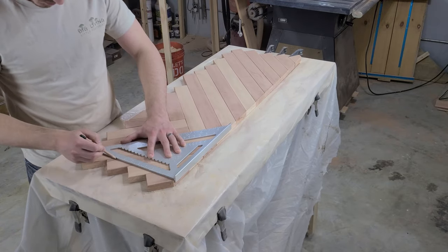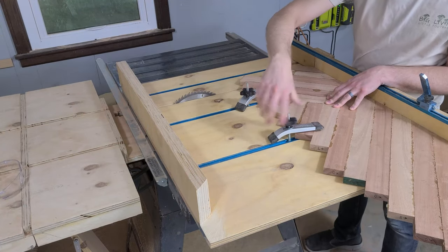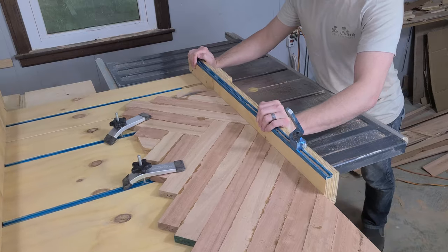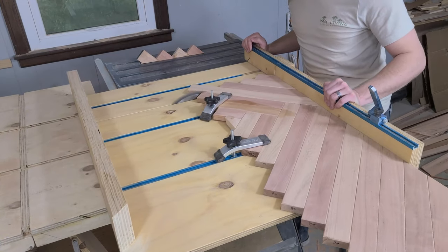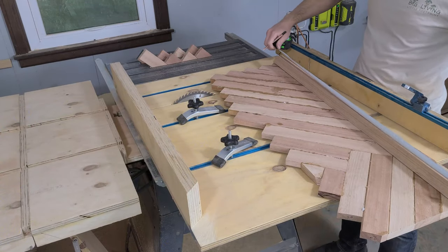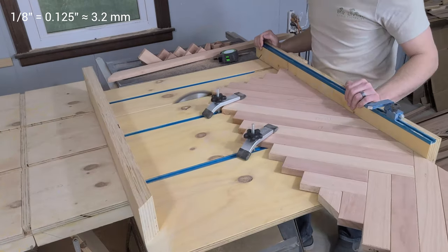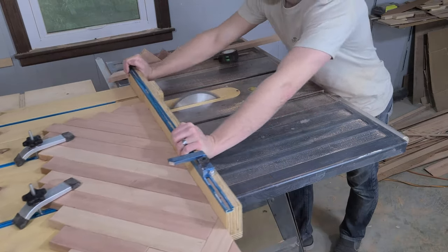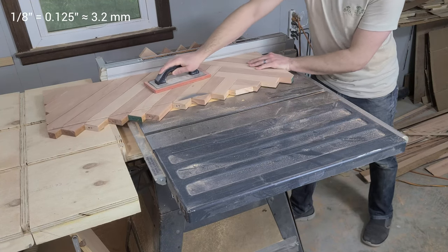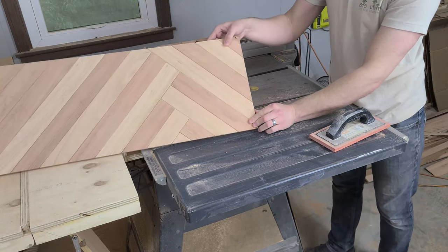We carefully mark the first cut so that our diagonal line hits the corner that we want, and then bring it back over to the table saw. Using the crosscut sled with our straight edge against the fence, we carefully cut on the line. Then we can flip the piece over to crosscut the second edge. To make sure that our panel is the right size, we first measure the length of the slot on the long frame piece and then subtract about an eighth of an inch and transfer that dimension to the board. All that's left is to set the fence and rip the last straight edge so that the panel is an eighth inch shorter than the slot in our short frame piece.